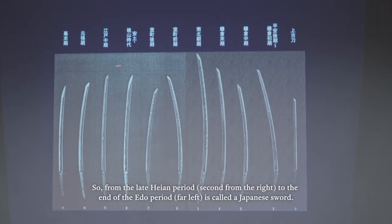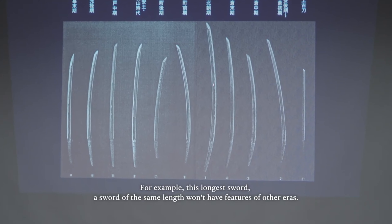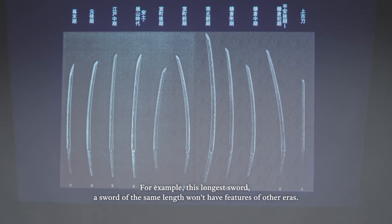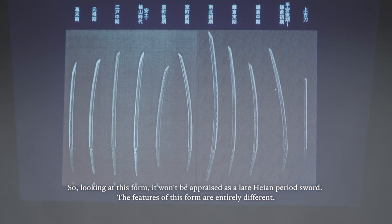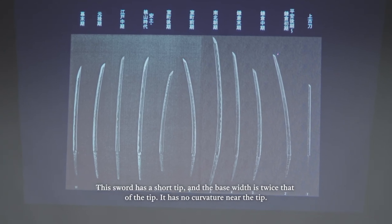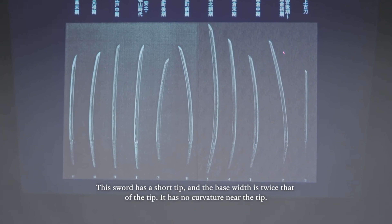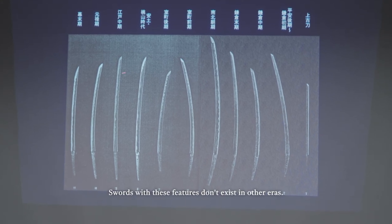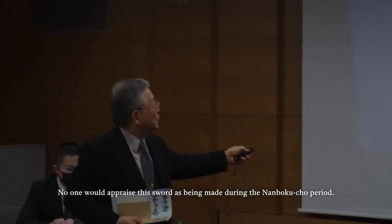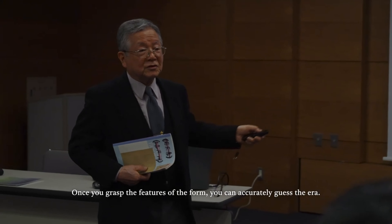Swords from the 16th century and earlier have been analyzed, where the carbon content was the same throughout all the swords — around 0.5% carbon. This means the blade was created with one single type of steel, just like counterparts in other parts of the world. Cross-section analysis revealed blades made without the lamination method, but from a single block of material. Were these swords inferior? No, not in terms of strength — they had no welding lines and no possible failure points inside the material. On the other hand, they had a softer edge, which is not purely a disadvantage, especially when the swords were supposed to be used against armor, unlike the later ones.